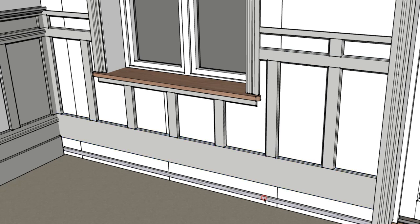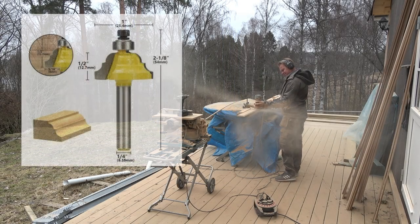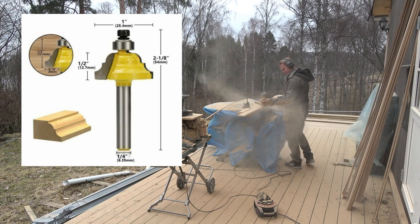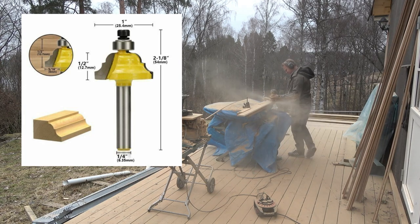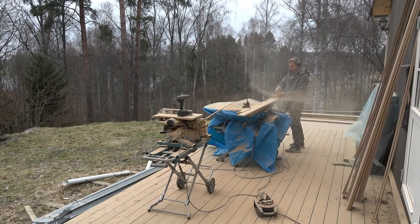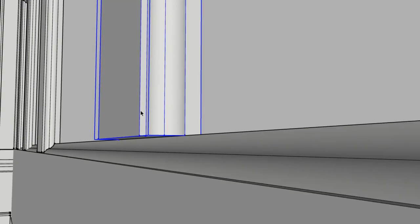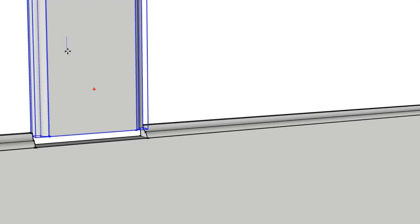I will update the drawings as I build the house. The reason I'm not going all the way down is to save material — we're going to cover everything with a baseboard at the end. But before we glue or nail anything at all, the pieces must be prepared by milling a profile edge. I have hundreds of different router bits, but I only use one kind for the whole panel — the cheapest and most common profile cutter you can get hold of: a regular Roman ogee cutter. But as soon as you have milled the edges, a problem occurs — it is not possible to join the pieces as they are, and you can't jack out the milling either.